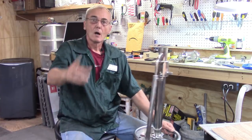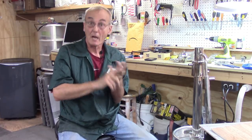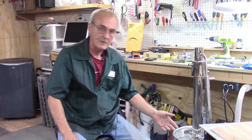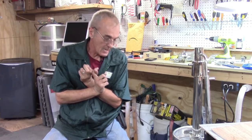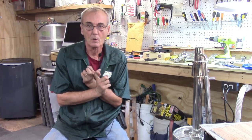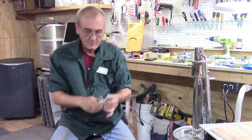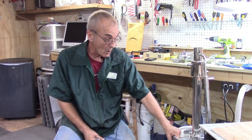There you have it — a two-inch column on a beer keg, ready to go. All I've got to do is wire it and plug it into my PID. So here's the recap: we measured up about three and a half inches, put in a 2,000 watt heater element, and dealt with an extra hole. I drilled a one and a quarter inch hole, so a one inch plug fit that, but for the heating element I had to drill a one and an eighth inch hole since it was slightly smaller. I also used the tap to cut some beginning threads to give it something to bite into, and it worked perfectly. Until next time — happy distilling!